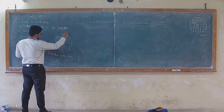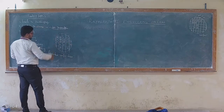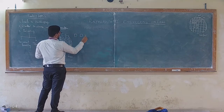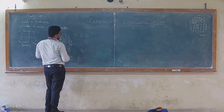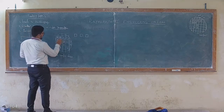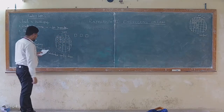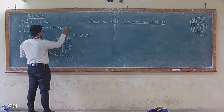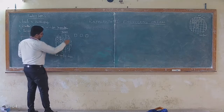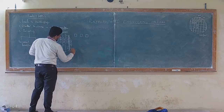I'm going to use a special cutting tool, called a diamond cutting tool. Using this special cutting tool, I'm going to slice or dice this wafer into single pieces. So I have a number of pieces like that. So each piece has its own die, right? So this piece could have a space difference between dies. It could be 20 micrometer space difference between these two dies, and 50 micrometer space between dies, and the thickness of the cutting tool edge, or I could call it a blade, right? So I could call it the blade thickness.